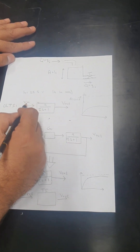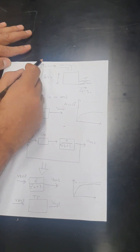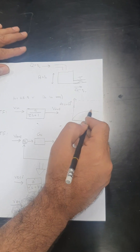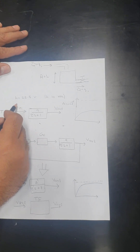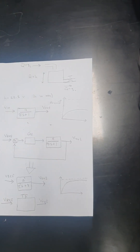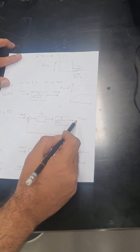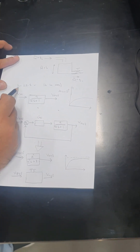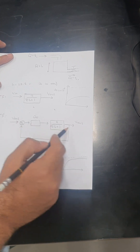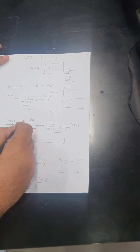This A over (τs + 1) is the open-loop transfer function, where V_in is the input voltage to the pump causing a change in flow q_i, and V_out is the output voltage from the sensor. V_in and V_out have no direct relation — V_in is the pump voltage and V_out is the sensor voltage, so they are not related. To build up a relation between them, you need a feedback loop. In the closed-loop transfer function, the reference voltage input represents the desired height in terms of voltage, and V_out represents the actual height in voltage. These are subtracted to get the error.